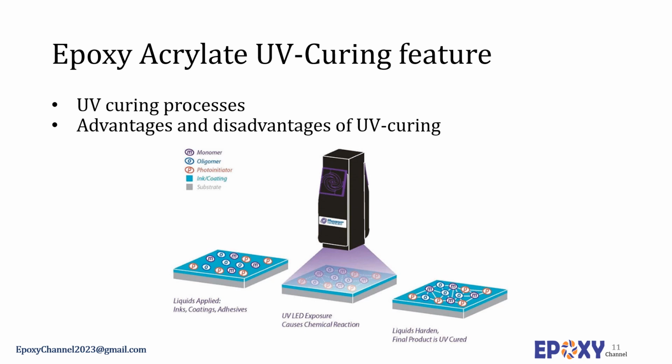The polymerization of multifunctional monomers or oligomers by UV curing has become a widely used technology that is found in many industrial applications due to its unique advantages. The coating industry is the most important application of UV curing technology and is used to protect the surface of materials with quick drying varnishes or printing inks. Other uses include manufacturing solder masks, stereolithography, and microelectronic photoresists.